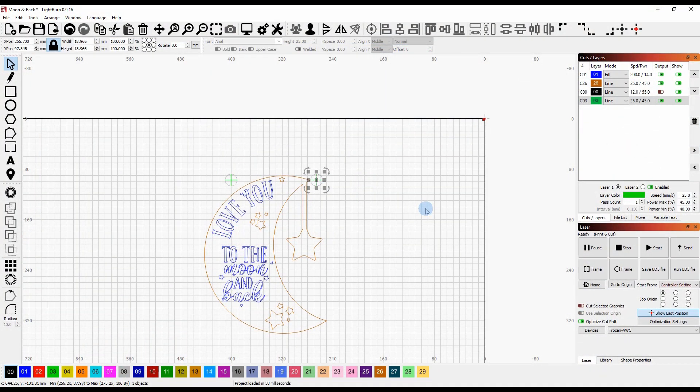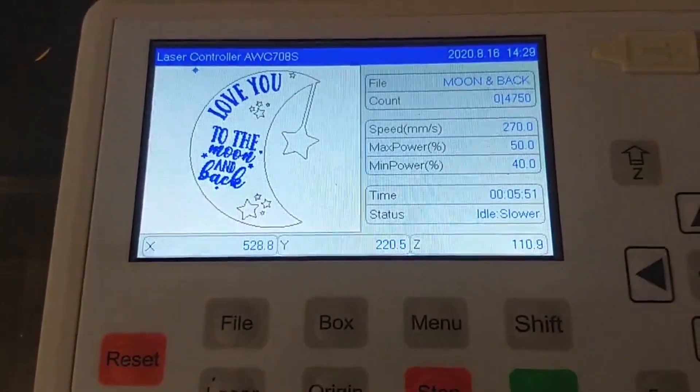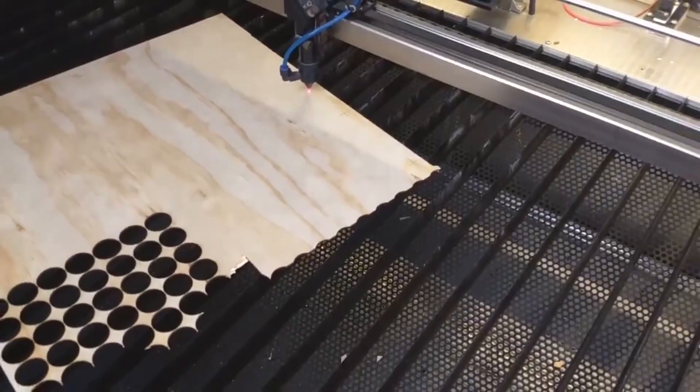After escaping back to the main screen, go to LightBurn. Before pressing send, turn off the cut for the green layer because we're not going to cut the targets again, but we are going to do the engraving and the outline cut — then press send. LightBurn rotates the image to fit the new cut positions, and then press start.